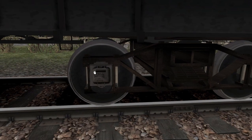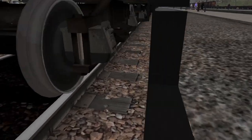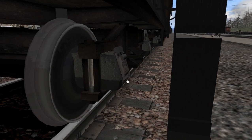This is something you don't see anymore, friction style or plain bearings. You would lift this lid up and you would fill the journal up with it. This whole thing right here is called a journal box, and it has a cotton pad in the bottom of it, and the journal comes through, and there's a brass on top with a Babbitt material on it.